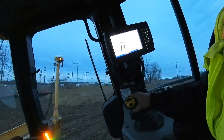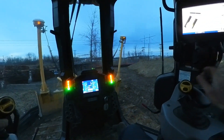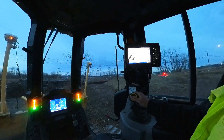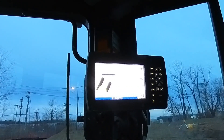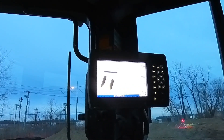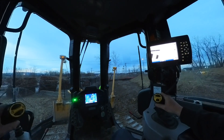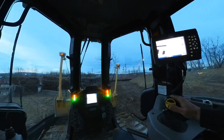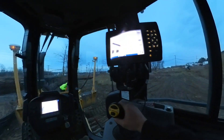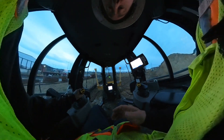We're going to go over the berm, stay right on the mark here. We're going to zoom in again and put this — right there's the other end of the culvert. Then we'll have him put a grade stake right there. Now you have your point to point, and you didn't even need a rover — you just string line it from one to the other and you're good to go. And that's how you set points with GPS in a dozer.